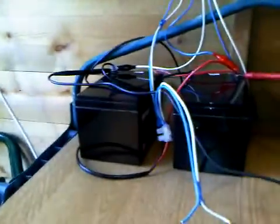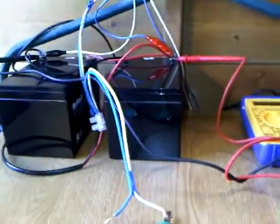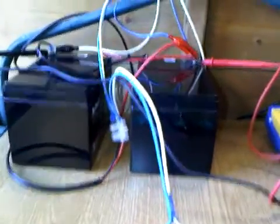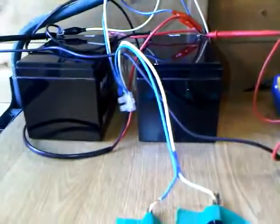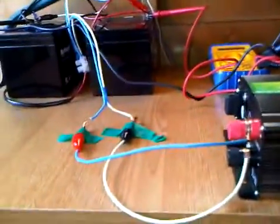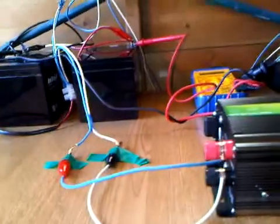My original two batteries are connected together. All I've done now is separate the cable coming from the charge controller so it goes into the batteries and into the controller. You can see that was syncing up pretty slowly — it's only a 12 watt panel, but it is actually putting out a full 12 watts to the house.